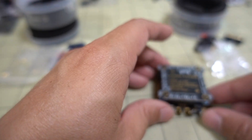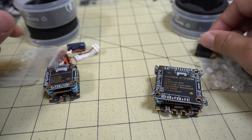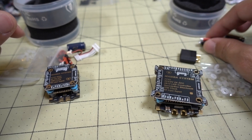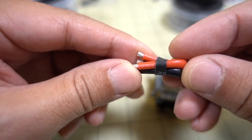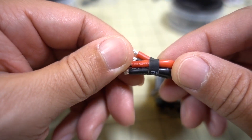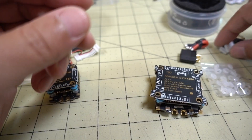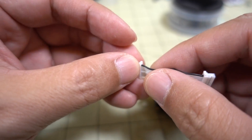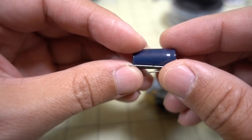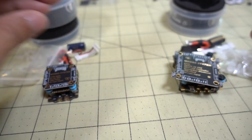Then we have the full-size stack here — flight controller and ESC — with the same silicone rubber O-rings. This one did come with an XT60, and you get some wire here, looks like about 16-gauge. You also get a wiring loom for the 4-in-1 ESC, which also looks like it's been upgraded to silicone, and the same 470 microfarad 35-volt capacitor.